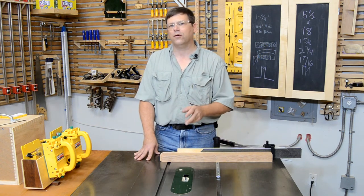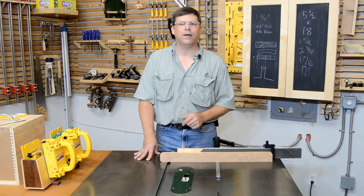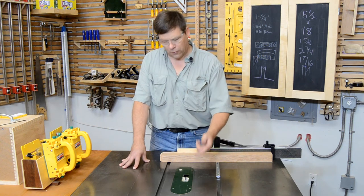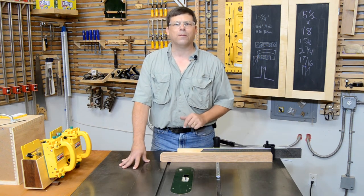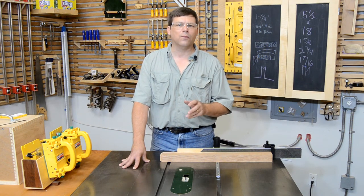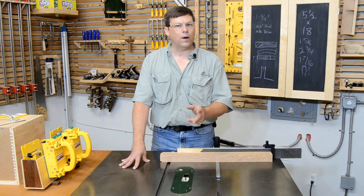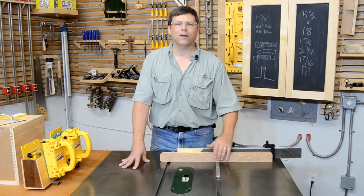It's one of those tasks that it can do better than virtually anything else, and this is the primary reason that I keep it around my shop. The other option is that if I wanted a single bead to wrap around, or even two beads, I could fairly easily regrind these knives to fit the profile I want to make. So it is very versatile and it gives me the ability to do some work — beads, coves, whatever I want to wrap around a square post so it can't be turned on the lathe. This gives me an option to do that in a way that nothing else can.